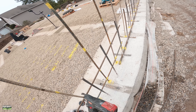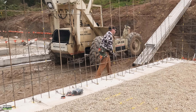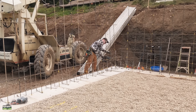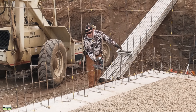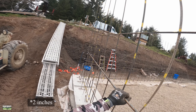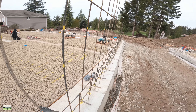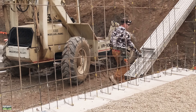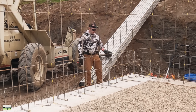Very well made — we're in seismic zone D2. I recently had a conversation with our engineer and he asked me: did you install it the way I told you to? Yes I did — and here is the proof. The big thing is you want to make sure that you have the coverage. Sometimes the rebar is called out to be one inch off the face of the form — that's tough. This was called out to be three inches so we had some room. When we place concrete, we will be using a concrete vibrator to help it consolidate around the steel. Sometimes there's so much steel you have to vibrate it or it won't consolidate properly.